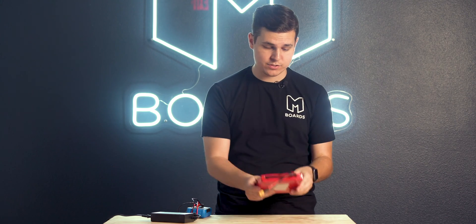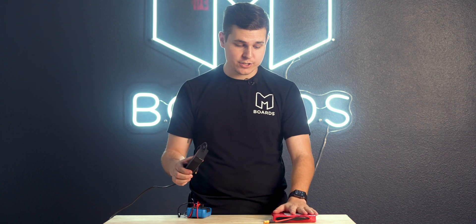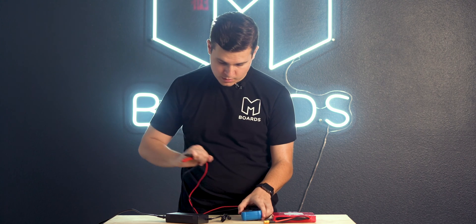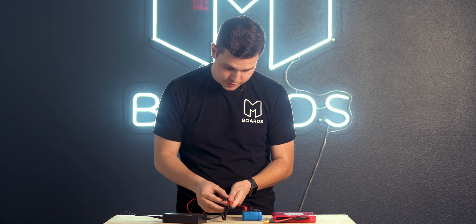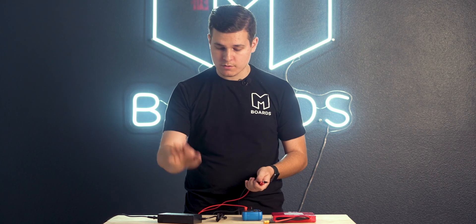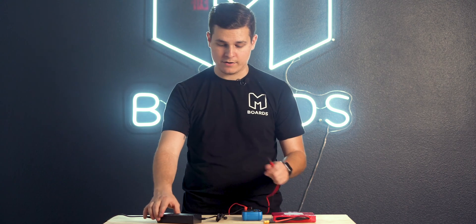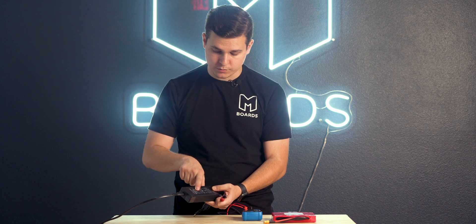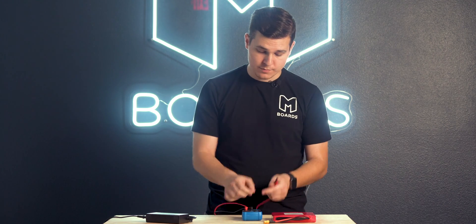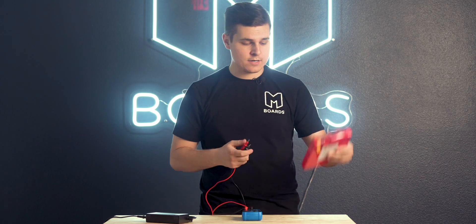Let's pretend I charged my battery and it was only at 34 volts at the end of charging — now we need to make sure the charger isn't the problem. Most of the time, if there are battery voltage issues, it's actually just a bad charger. To test the charger, turn the voltmeter to DC reading, plug one probe into the center of the charger and the other on the side — we're getting 42.1 volts. So our charger is good, that rules it out. If you're using a 6S charger, it would be 25.2 volts. Our charger is fine, our battery is fine, so if all voltages check out, it's most likely an ESC issue.